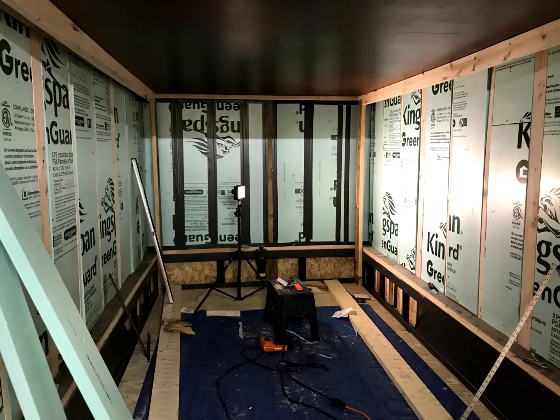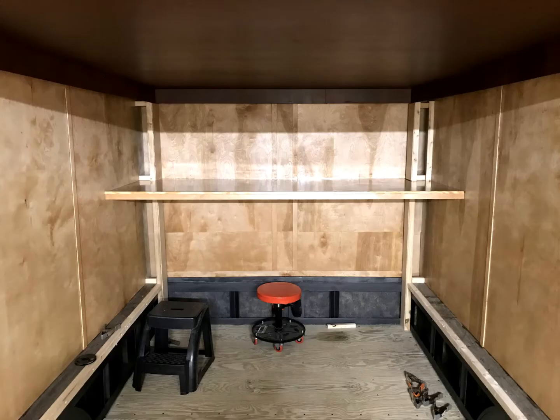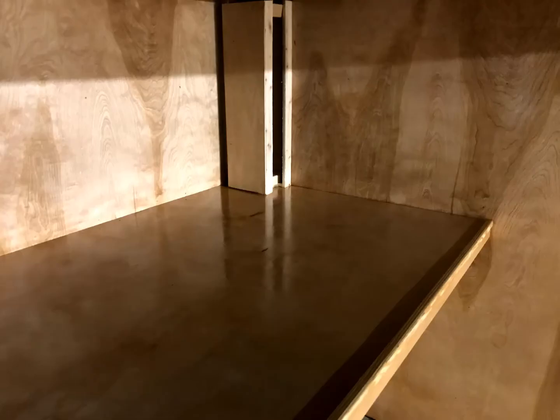Now for the interior. We used the same 1.5-inch solid insulation and paneled the inside with the same material as the ceiling, but only used clear poly on the walls. The paneling we used for the interior was from Home Depot and is actually flooring underlayment, less than 1/4 inch thick, but it looks great with poly and was less than $14 a sheet. Again, all the seams were taped prior to putting in the interior paneling.